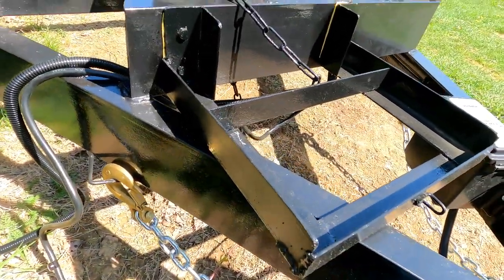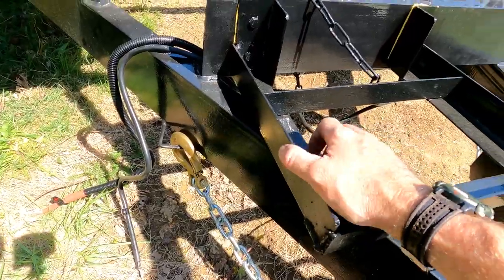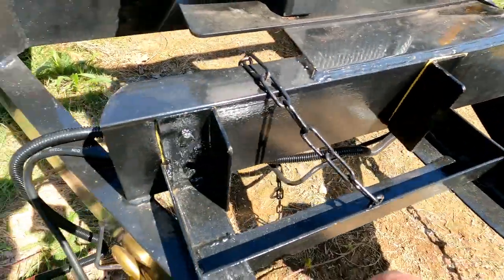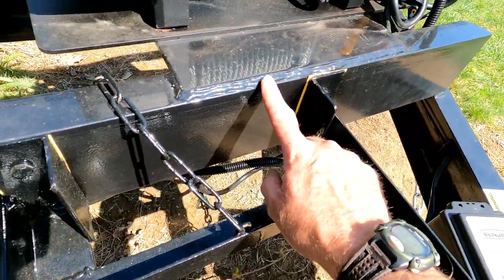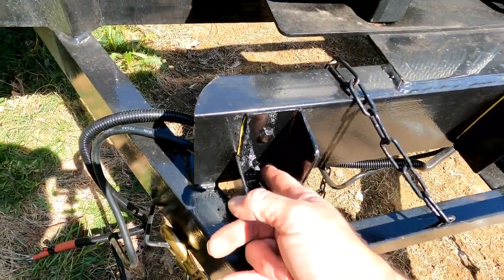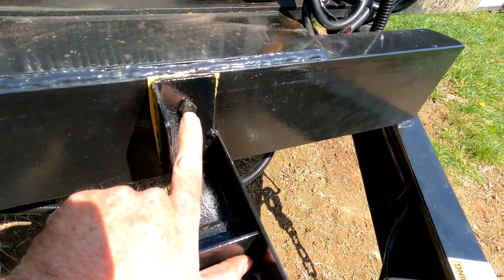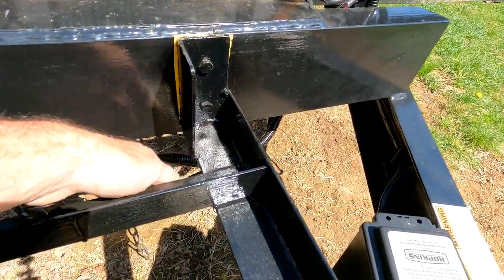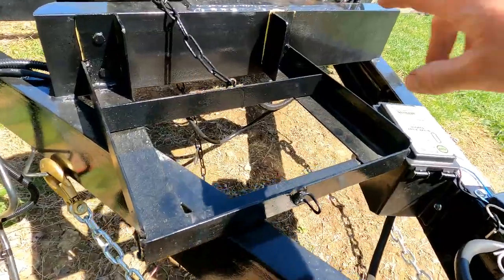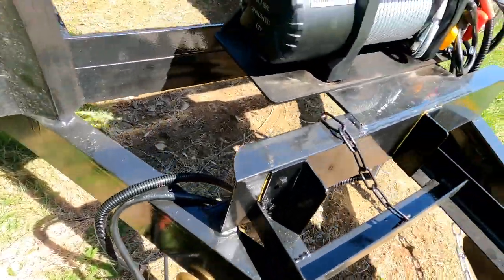So this is the battery box that I built. It's just angle iron. I think these thinner ones were actually just bed frame. These I bought — Tractor Supply or Home Depot, I don't know. So just welded it up, drilled it right into this plate, the winch plate that came with the trailer. I have grade 5, 5/16ths bolts holding it. I am going to change this top one here because I want to use a cable clip on the back side. I need a longer bolt. The only longer bolts I have are grade 8s — not because grade 5 isn't strong enough, but just because that's the only longer bolt I have.